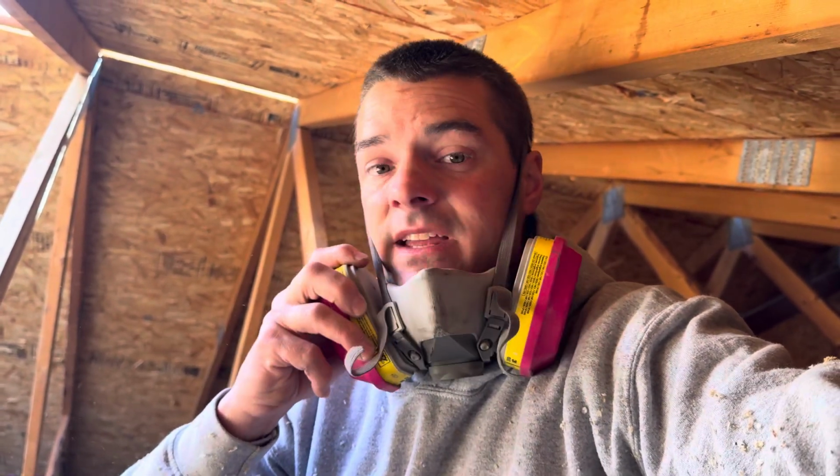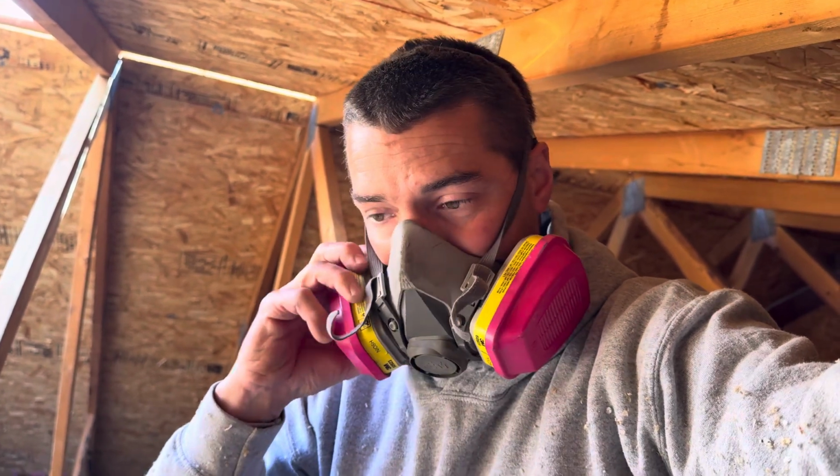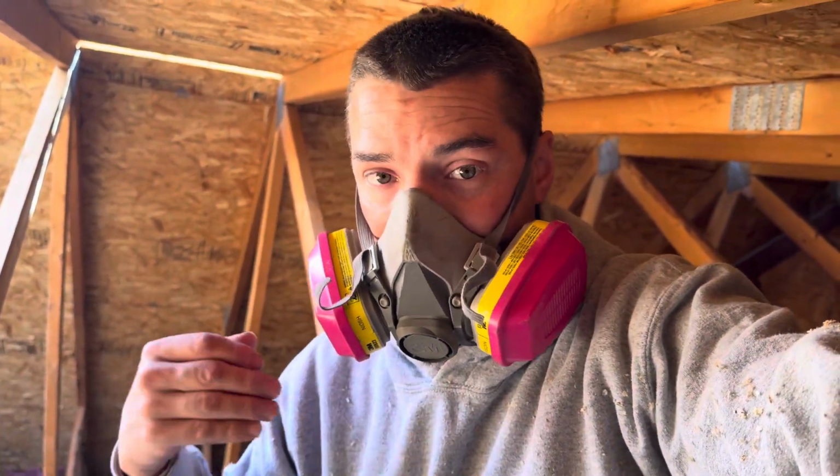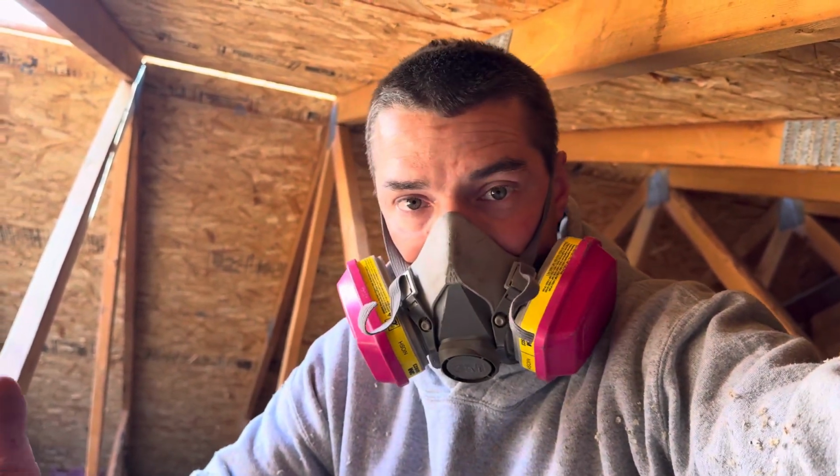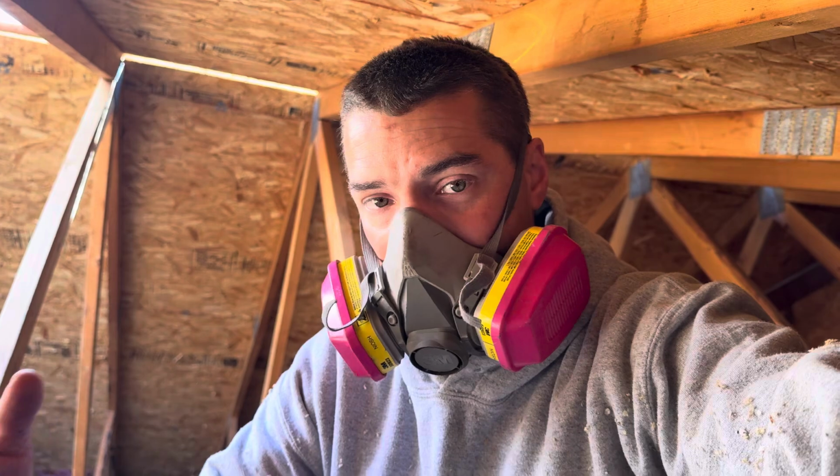Downside is it's kind of corrosive. So if you've got plumbing, not plastic, but like copper, any kind of metal that could have an issue, it's possibly going to affect it long term. It also settles a lot more in my opinion. So if you're going to have insulation done, one, make sure you check the area. Make sure you're not blowing it over your soffit vents. Make sure you're not burying exposed or unexposed electrical, junction boxes, bathroom ceiling fan vents, can lights, things. There's a protocol to it.